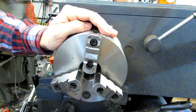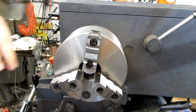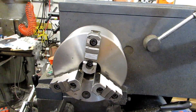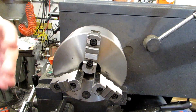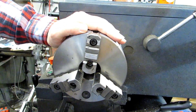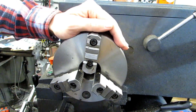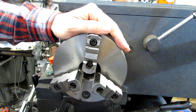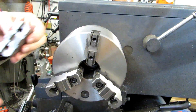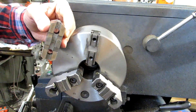When it came time to replace the chuck on my lathe, I got one with two-piece jaws. You can see the jaws are held on by two screws each. That gives you a couple of advantages. First and foremost, you don't have to hunt around for where you put that extra set of jaws if you've got one-piece jaws, because you can't just turn those around — the angle of the scroll prevents that. This particular chuck uses the tongue and groove method of holding the jaws on, which seems to be the most popular over here in the States.